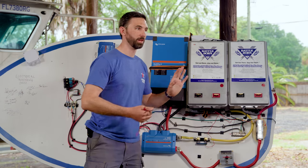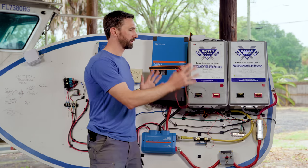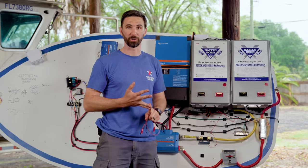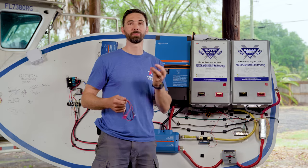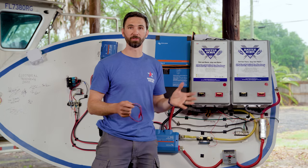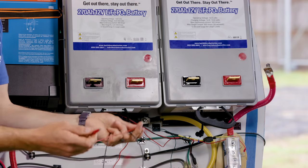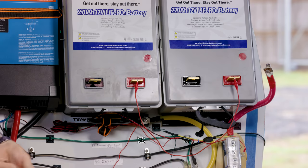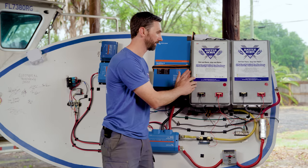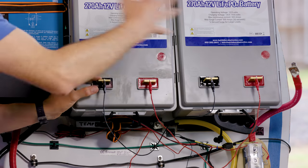When you are designing your own power system, you have to determine both the capacity of storage batteries you need and the voltage your system will run at, and that configuration will dictate how the batteries are connected. Let's look at the two ways to wire a battery bank: series or parallel. This is a mock wiring setup powering an inverter. This system needs 12 volts. For a parallel configuration, you would connect these batteries positive to positive and negative to negative. You've maintained the voltage of the system at 12 volts and now have over 500 amp hours of power available. To connect this to a boat or RV, connect the terminals to evenly distribute the load across both batteries.